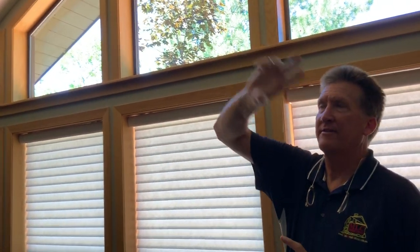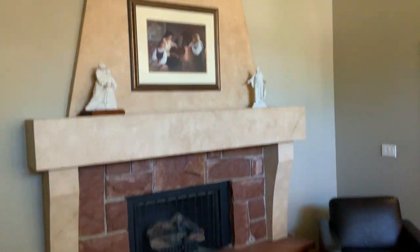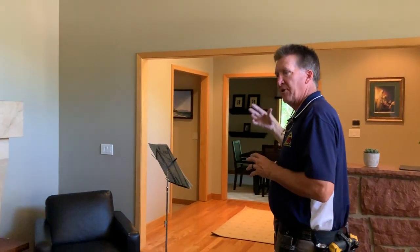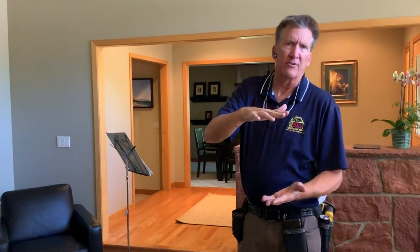In here, the vaulted ceiling design. In our attics, there are two attic accesses. Here's our issue. We have blown-in fiberglass insulation with fiberglass bats on the vertical walls. A couple of the fiberglass bats have fallen down and could be repositioned. But they've gone up there to upgrade lighting and everything else and run new wiring, and they just traipsed through the insulation they had. And so in some places, it's only this deep.